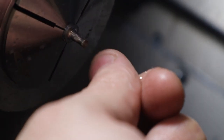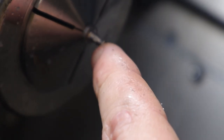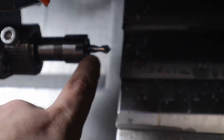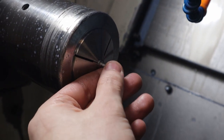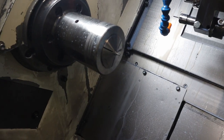What I want to do is get a 90 degree spot drill, and after drilling and tapping, or probably drill then spot drill, let's put a nice chamfer, because the form tap I'm using actually leaves a burr on the end, and it'd be nice to have it nice and chamfered. And that's why I have this backwards facing drill, because when we go to transfer this into the sub, we'll be able to actually put a chamfer on the end of that thread and make them pristine, if you will. But for now, I'm just coming in and facing this surface after it taps, and that cleans it up a little bit, but that's more for testing purposes.